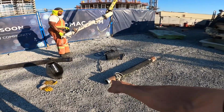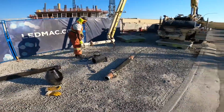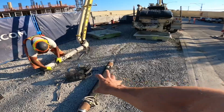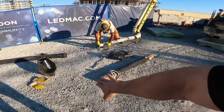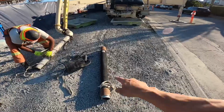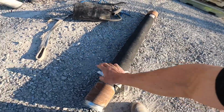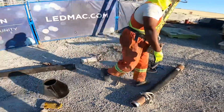So we will have a short 4 to 3.5 reducer, 3.5-inch line. And then when we're out of the line work, we're going to have the air cuff on here. We'll activate the air cuff to pinch this short hose off. We can buck off the line and reducer, and then we'll grab a 4-inch whip hose. We'll fasten it to this short double-ended 4-inch hose, connecting a safety sling between the two hoses and a clamp with a safety pin, obviously.